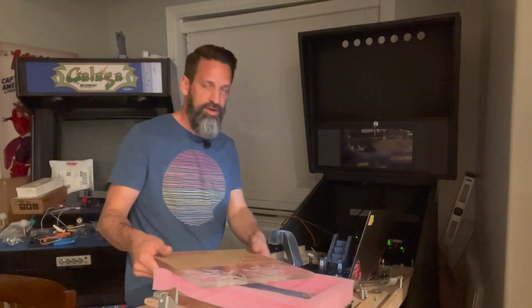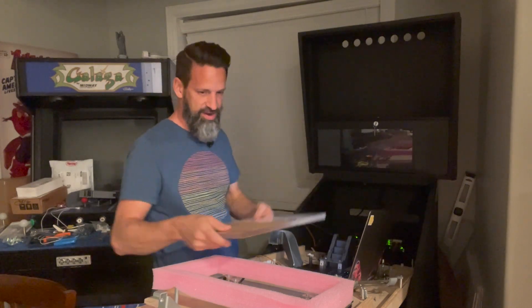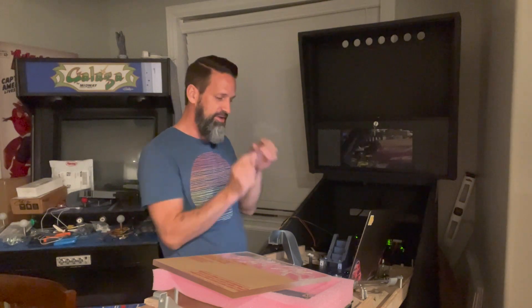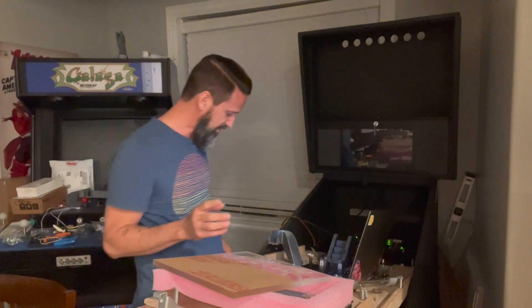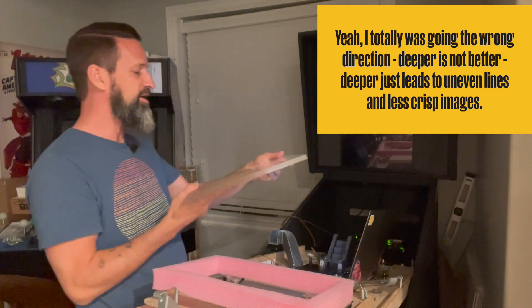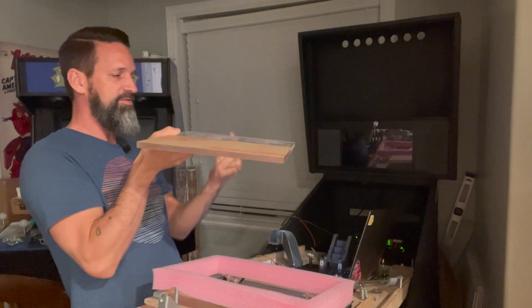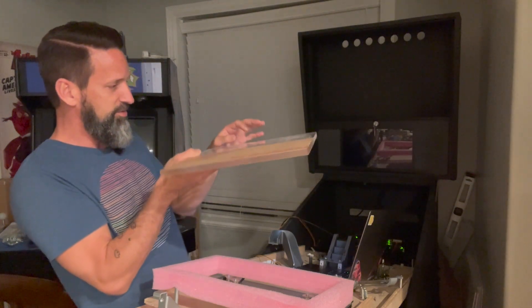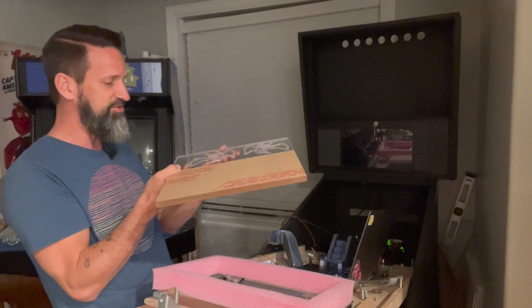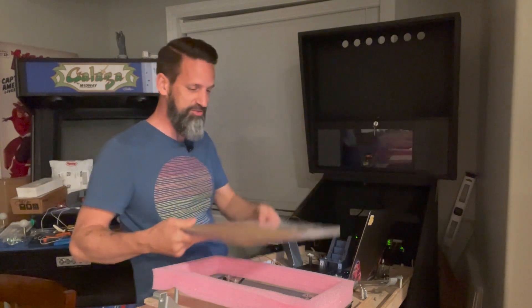Let's turn down some lights — now we're back here in our dark little cave. That's what it looks like. This is the smooth side up, the etched side down. I was worried I might need to make the etching deeper, but I looked at one of my kids' toys — a thin 1/16th inch piece of acrylic edge lit from the anime Naruto — and it's got very fine etchings that catch light just fine. So I don't think I need to etch deeper. If anything, I maybe etched too deep — if I look at it from the edge I can see the different depths of the laser. It's almost a cool effect, but probably way more than we need. That's why we've got more acrylic to test with.